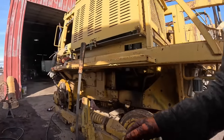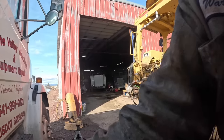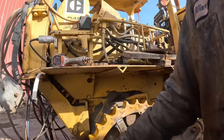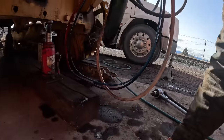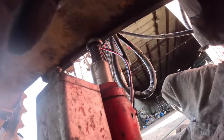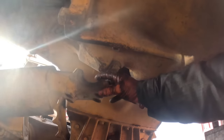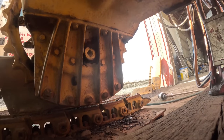Okay. Now, another lesson that I've learned in doing these. The bearing fell out on this one trunnion cap, and there's a cap laying on the ground. If you can get that trunnion cap in there right now, then you got to pay attention on these trunnion cap bearings. See the offset here? You gotta make sure the offset's the other direction on the cap.